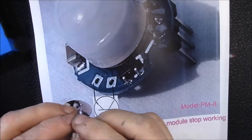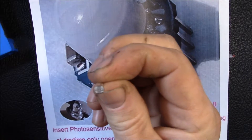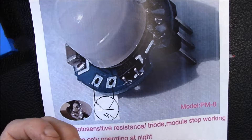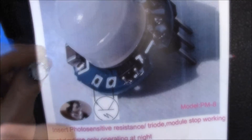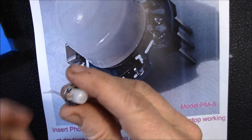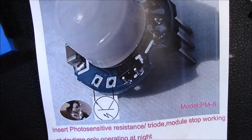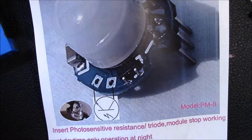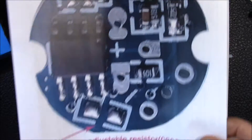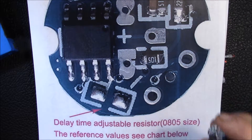Here's one of the light dependent resistors — it's also a tiny little part and I think this one should fit right in here. There we go, I've stuck in the light dependent resistor. I'll solder this in and see how it works. That keeps it from operating during the daytime, which is one feature I wanted.